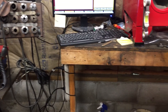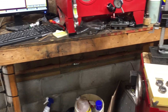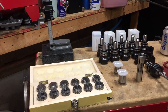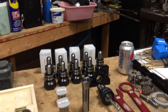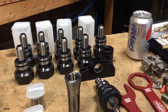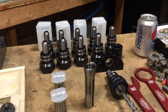Hello, good afternoon YouTube fellas. We've been working on our mill - we ordered a bunch of new parts, got the update installed on the Masso finally, and we've been playing with it. We ordered a bunch of new tooling, all from Tormach - their TTS system for the R8 collets. We got the tool setter block so we can set tool heights, the ER32 wrench set, and their flat R8 collet. This part right here has a one-way bearing so you can put your tooling in and out without having to be in the mill - it holds it still for the wrenches.